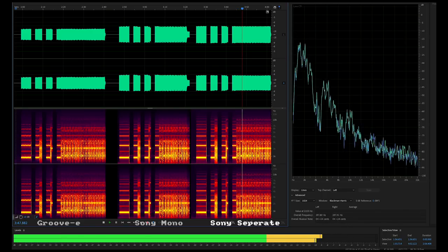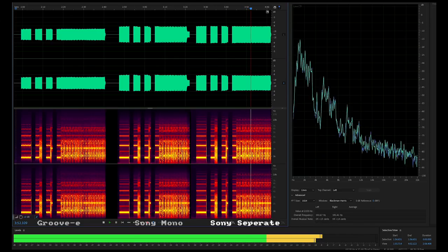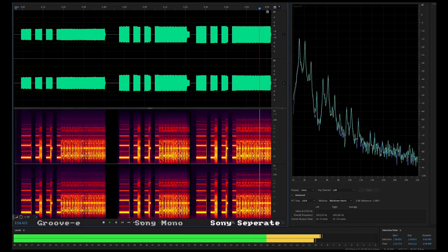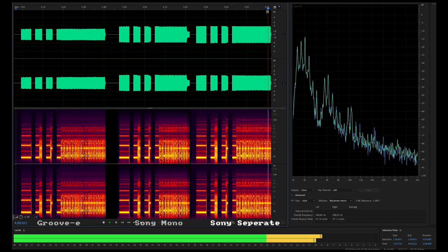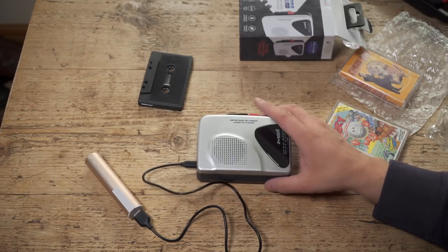And if you look at those heat graphs at the bottom, you can see all the energy in the computer signal on the Spectrum is between 1 kHz and 2 kHz. You can see the two bars. Don't get confused by those other bars. They are just harmonics created by the tones at that volume. So the computer won't pay any attention to them, but you will hear them and you will see them on the graph, but the computer doesn't care. It cares about 1 kHz and 2 kHz.